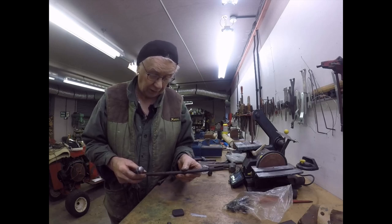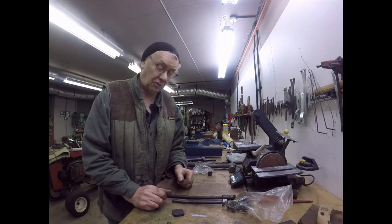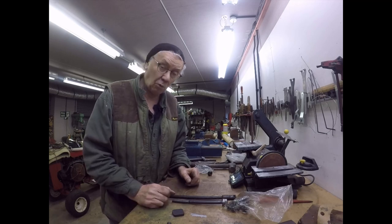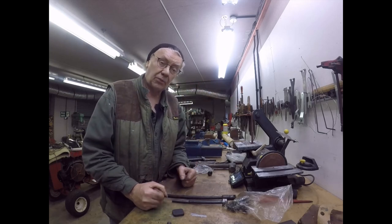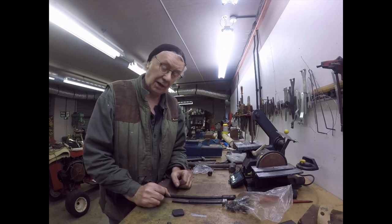I'm going to now crack on. I'm going to make the Whitworth one, and then we have a full complement of long and short drawbars. I bet it'll be another one of these sooner or later. I might have to make some long ones in awkward threads to put the fittings in the horizontal NT30 fitting on the Harrison.